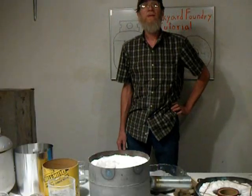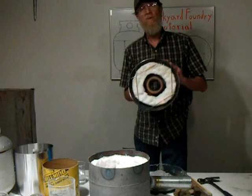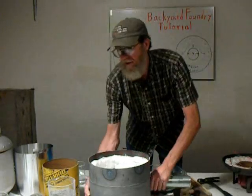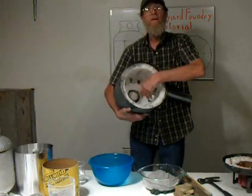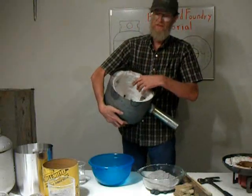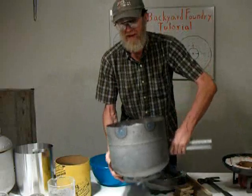Now we're pretty well ready to start mixing the refractory cement. We've got the lid with the reinforcing wire welded in it — we just drilled a hole through it and welded the wire on the outside. We've got the cardboard tube in the center, the boundary all set up, and some extra pins of wire to help hold in the top. We've got our bearing surfaces. We're going to mix up the cement and by hand pack it into all of our bearing surfaces first, then add the center tube, packing the bottom and working upwards.